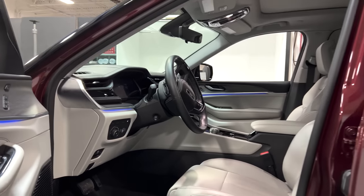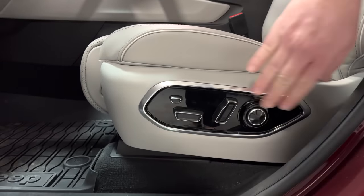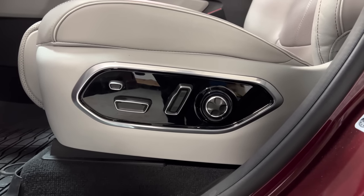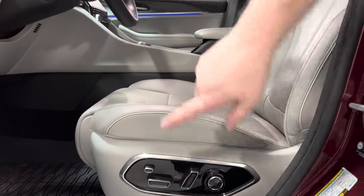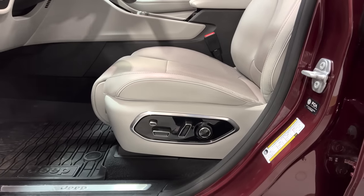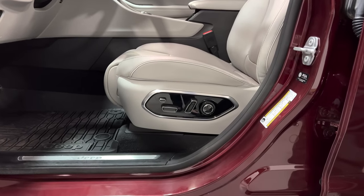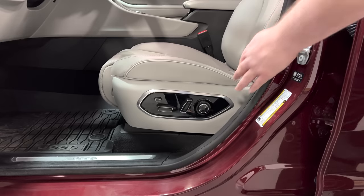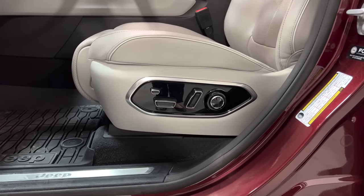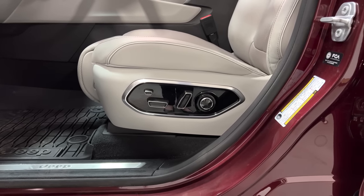There is something, however, that I really like on the seat side shield. The entire switch bank is an A-side load. So why is that important? A lot of the side shields that we saw, the switch would load from the B-side and then all of these buttons would pop through little tiny holes in the side shield. What this does is allow them to change up the style a lot. These buttons and the switch itself may be common from vehicle to vehicle, so their whole placement has to be common. But this decorative trim gets to change. So they can get a lot more design flexibility with a system like this, still keeping the same switch itself, but have all of the garnish trim around it be different. So I like that type of execution.